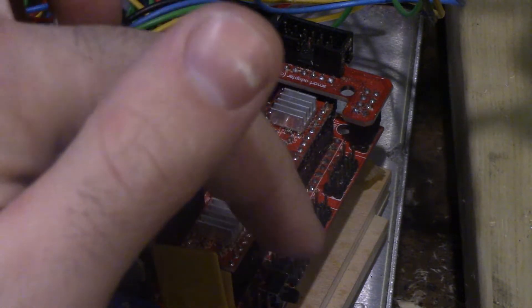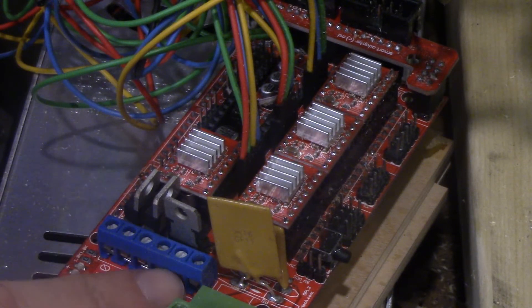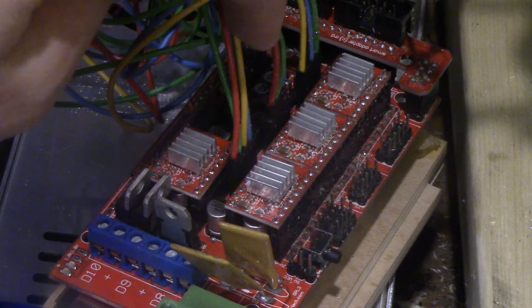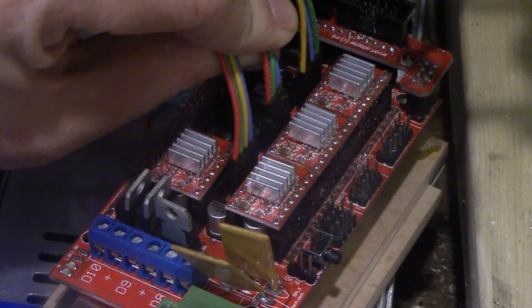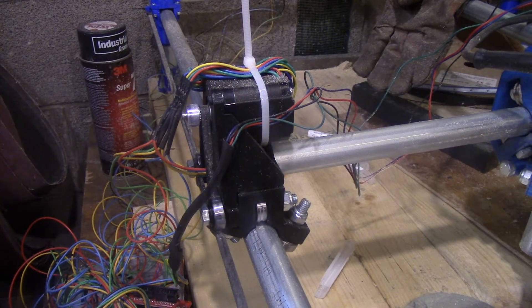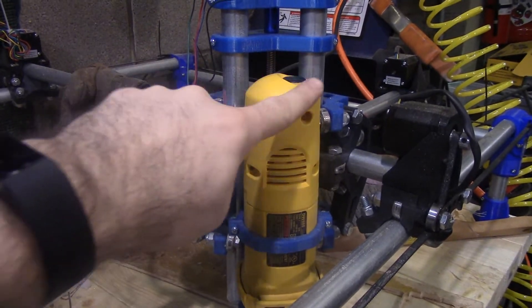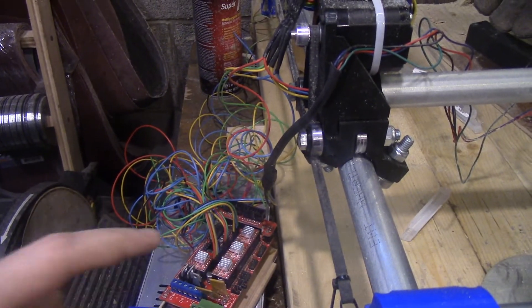Oh, there's a piece of wood. Anyway, this is a RAMPS board. In this case I have no end stops, no hot end, no print bed, no second hot end — nothing. I literally have three sets of steppers: one for Z and a set for both X and Y. This printer has a stepper on this end, same axis, stepper on that end, same axis.